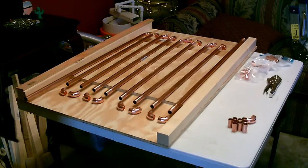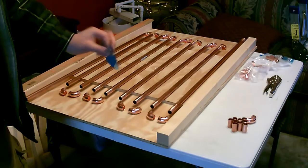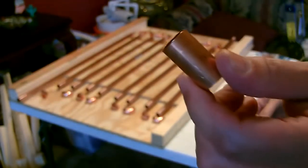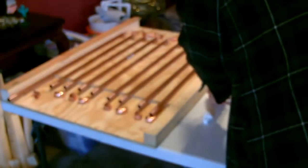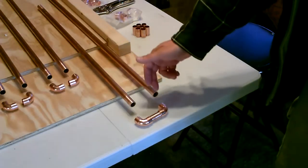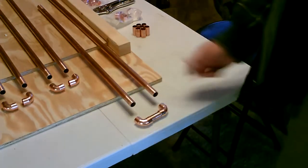So that's the basic layout right there. Then we've got to do a couple things to prepare this for the soldering. First, take a little piece of 120-grit abrasive cloth and shine up the end of each pipe. I'm just going to do the little ones. Okay, time to solder — add the flux here, here, here, and here. A little bit on here. Push this together, put it on there, and fire it up.